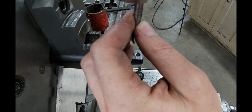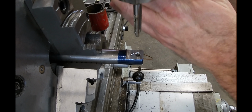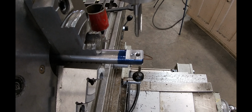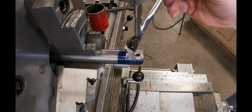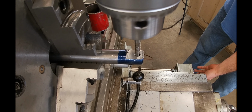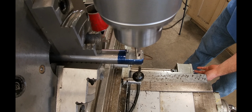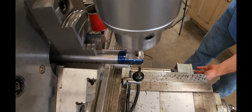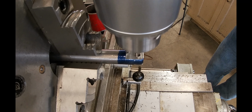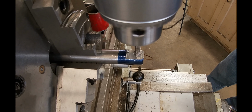And I go ahead and I power tap using the drill chuck. A quarter 20 tap probably is not going to spin in the chuck if you tighten the chuck tight. But larger sizes, we'll always go and use our tap drivers. But I feel like on this one here, this is a pretty safe, low risk operation. I get to the bottom, you see the tap is coasting freely, and then I reverse the spindle and use very light upward pressure so the tap clears the part.